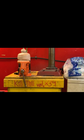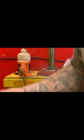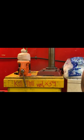Which I know for the container that's on there now, that's not going to work. I used the number 20, but I felt like it was a little bit too big, the hole that it produced. And obviously I'm doing this with a hand drill, so it's not the most accurate. It could be egging things out or oversizing it a little bit, but since it's not a metal part and it has to be epoxied in there, and it's already questionable how well it's going to work, I'm not going to take the time to go and set it up in one of the mills. Okay, this is a 21.